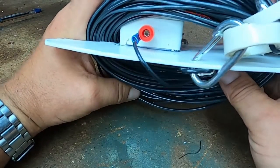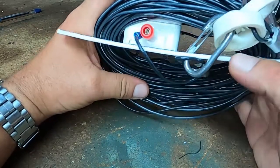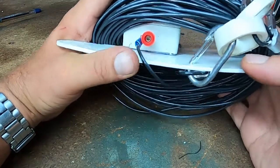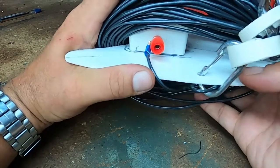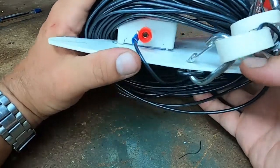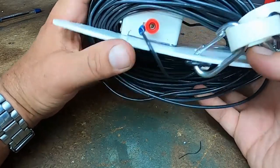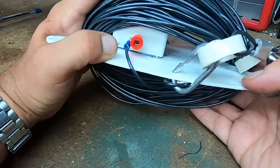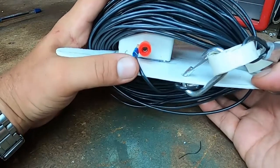And if you're going to use it for propagation, there's many different ways in which you can set this up. You can set it up as an L, in the L-shaped configuration, or a sloper configuration for more of a general purpose use. That would require two posts. So you can check out our mast videos about how to set up masts, some cheap and quick, inexpensive masts. If you only have one connection point, you can set this up as a V as well, which gives it a little bit more directional capability.